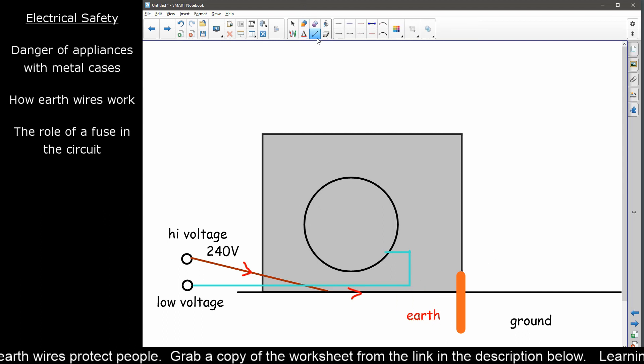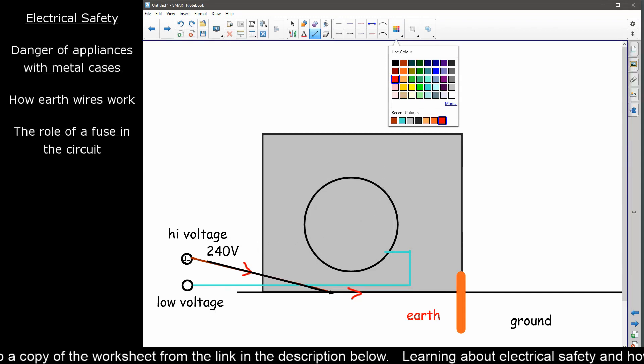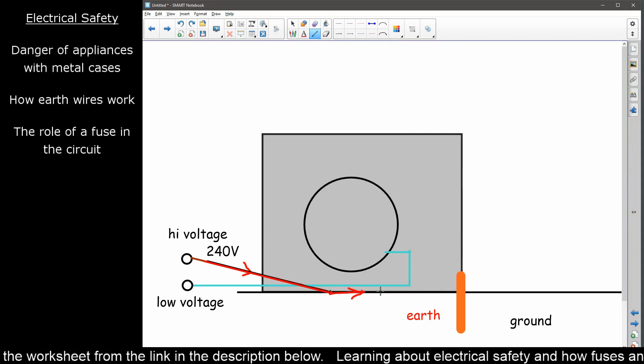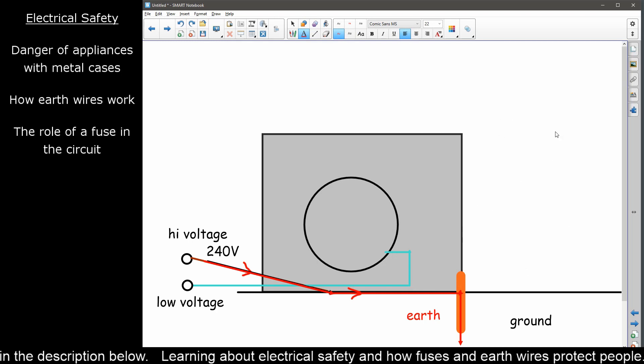Except when we come and touch this again, we've formed a bit of a parallel circuit and danger is going to happen again. Because this path has pretty much no resistance — it's good quality metal all the way — that means we're going to have a huge current, which is going to generate heat, and we're probably going to set our house on fire long before anything else happens. So this alone is bad — we do have high current traveling, and this would not be good.